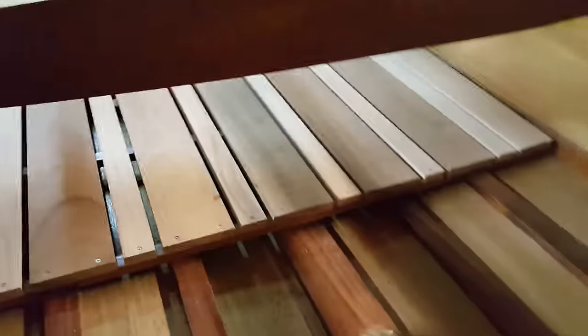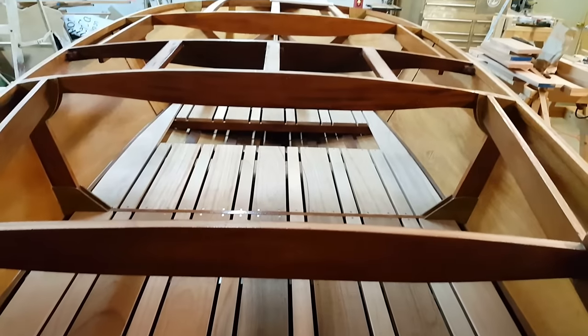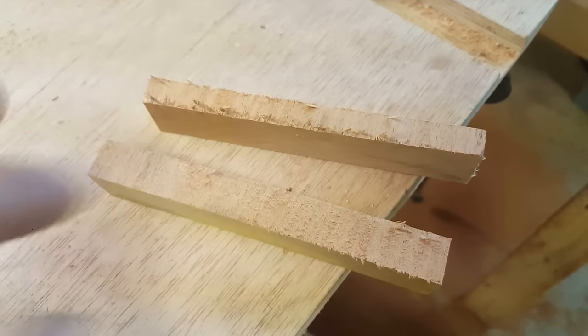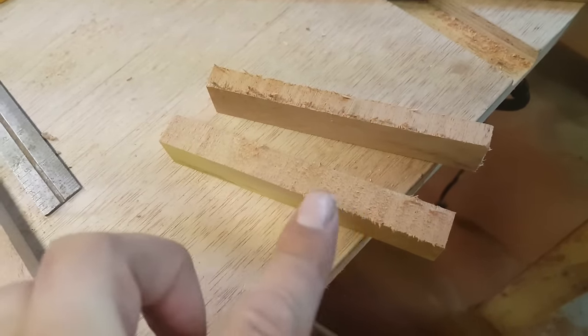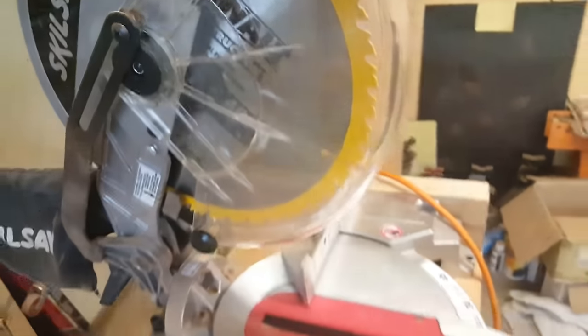Awesome — we're probably three quarters done with the planking. Making fantastic progress. Here's a quick comparison: this one is the factory blade that was on my Skil 10-inch compound miter saw, and this one is after I replaced it with a DeWalt blade — basically the same version as my table saw blade. Much, much cleaner cut. You can see all the blowout on the backsides of the old blade; the new one has very slight blowout. That was about 30 bucks for the blade.